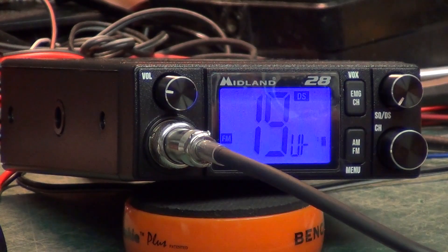Obviously it's a multi-norm. We got 2.9 watts out of it, something like that, and the deviation was low — we can't adjust that. And if it's the same transmitted audio as on the 18, it left quite a lot to be desired because it was a bit AGC laden.